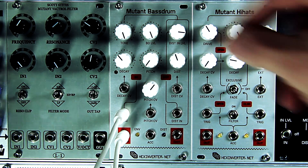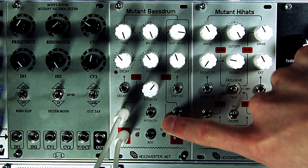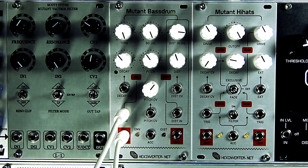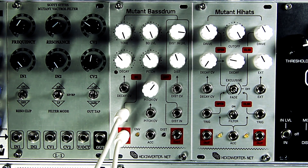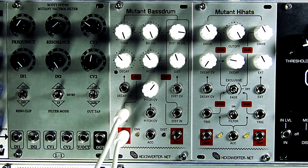You can go subsonic. The pitch is fully voltage controlled via an optocoupler. Plugging something into the pitch CV input gives you approximately volts-per-octave response, though you won't get exactly musical response — that's just because the core of the 808 bass drum is a fairly unstable, unpredictable circuit to begin with, so tuning that precisely would just be too costly. Even so, you can create really cool bass lines and use the bass drum module as a synth voice by voltage controlling the pitch, decay, and distortion parameter, getting synth sounds that aren't even really bass drums. So it's fairly versatile.